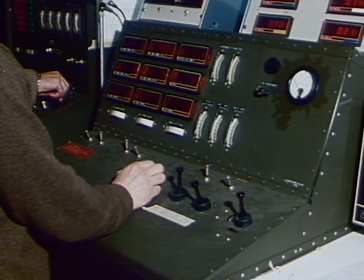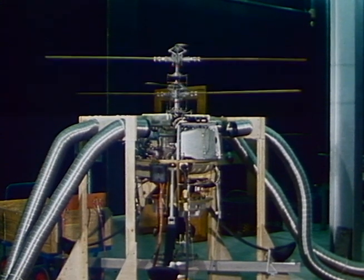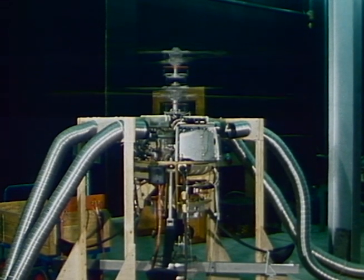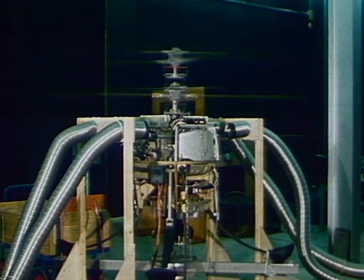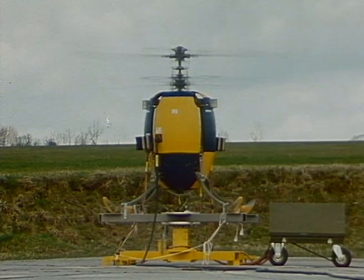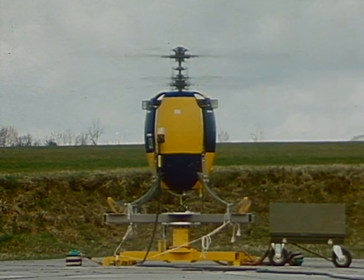Engine and rotor speeds, cylinder head temperatures, lift and yaw loads, and loads in the highly stressed dynamic components have all been recorded. Following exhaustive ground running in the enclosed cell, the vehicle is finally cleared in the open air, where there are no aerodynamic recirculation problems. This final check-out covers the accurate trimming in yaw on a freely rotating tie-down rig.